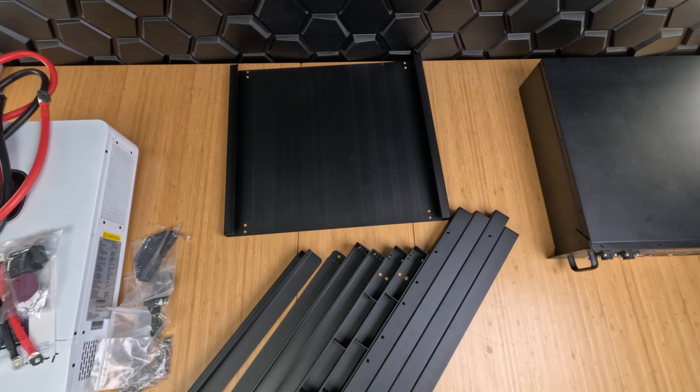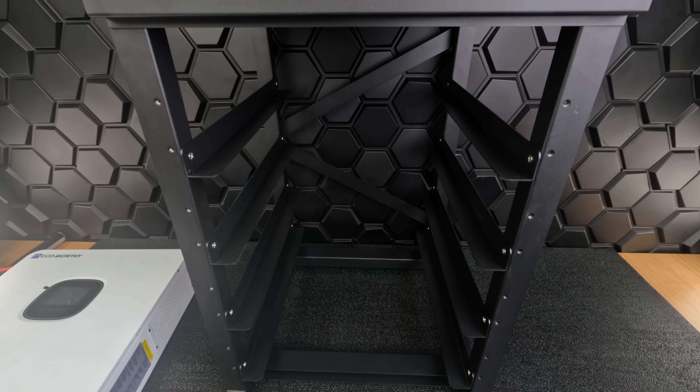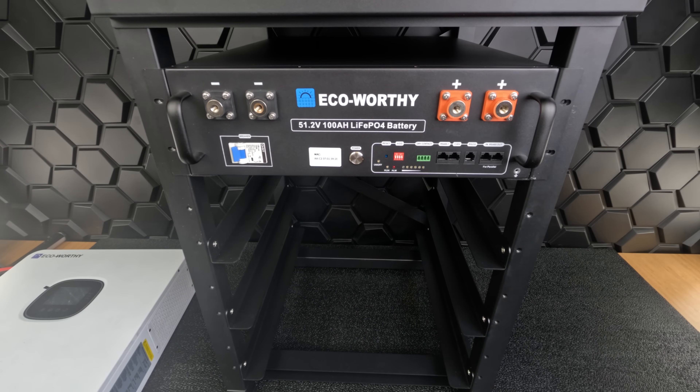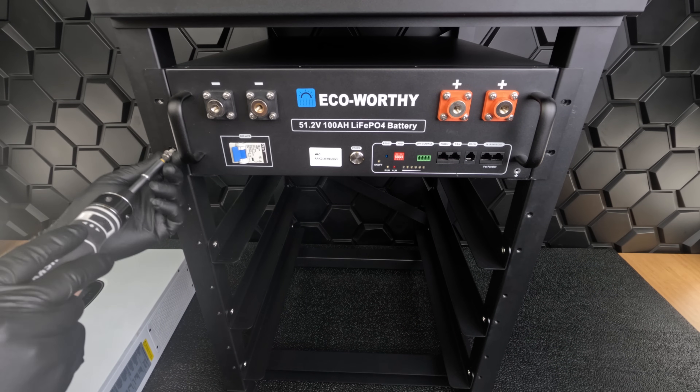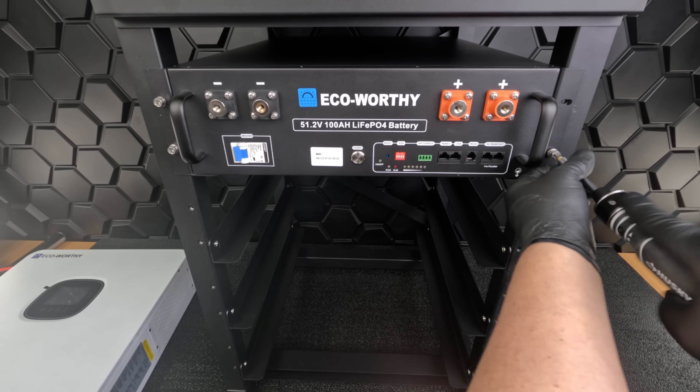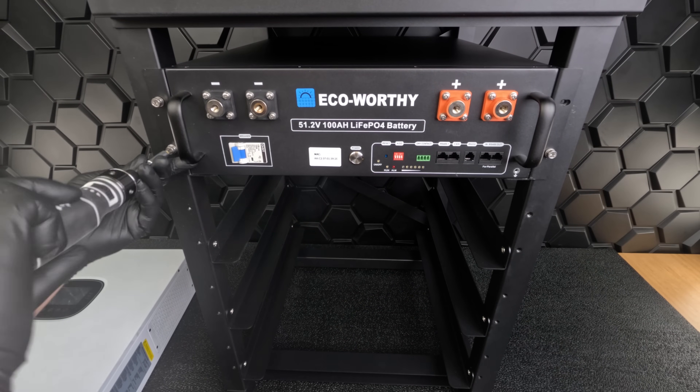Here's our complete server rack kit. It might seem like just a pile of metal rods, but we promise it will come together. Here's our battery rack assembled — this is not a very hard task. If you've ever assembled furniture, you should be just fine. Let's mount one of the batteries. These are 95 pounds more or less, so it'd be wise to have additional help to load these into the rack. The battery just slides onto the slot and gets bolted on to ensure stability. Bolting down the batteries is a great idea — it keeps the system safe and stable, so you don't have to worry about the batteries moving when you shift the rack or if there's an earthquake, for example.